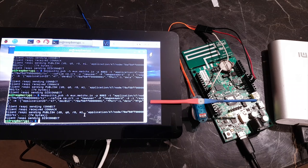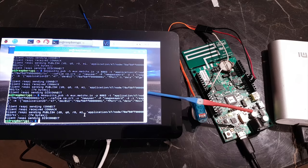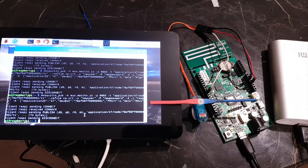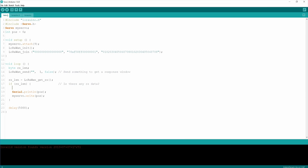The MQTT broker also has to be used if you want to send data to a device — a device like a LoRa Wino, for example. That's not a Magic product; one can tell by the lacking snappiness of the name. But like every other LoRa product, it's compatible. So I can now control servo motors kilometers away — finally. Setting this up was a bit inconvenient because I had to base64 encode the command before sending it, only to tediously decode it in the LoRa Wino program. But it's all still new, and I'm sure it'll get better as soon as more users embrace this technology.